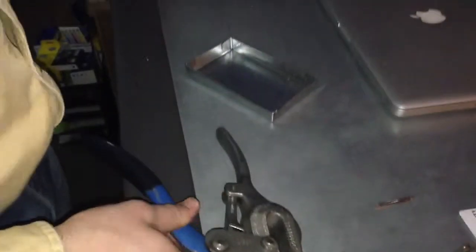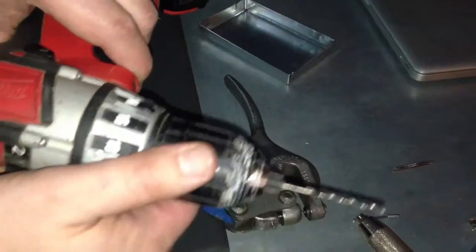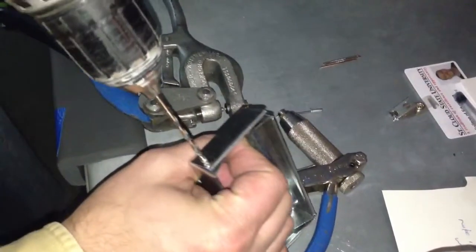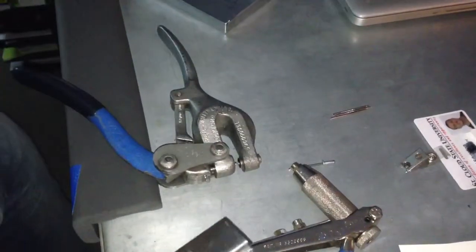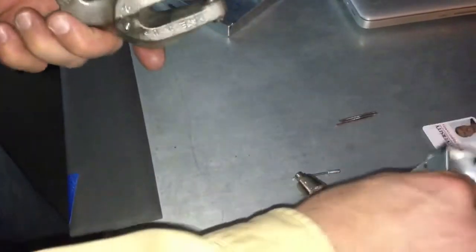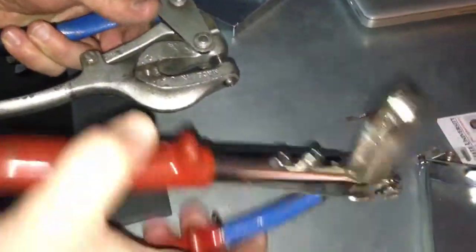Now we could use a drill with an eighth inch diameter as well. This will work, but drilling into sheet metal like this is a little bit sketchy — if you push too hard you could drill through your finger. So a drill will work if you don't have a Whitney punch at home and you want to use pop rivets. We're going to use the Whitney punch because we have them, and then also a pop rivet gun.